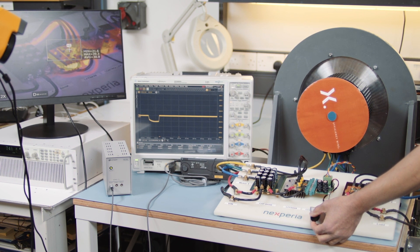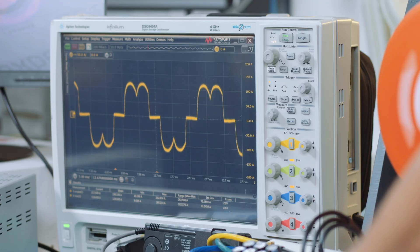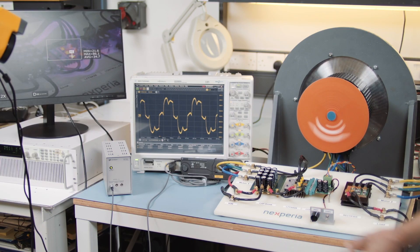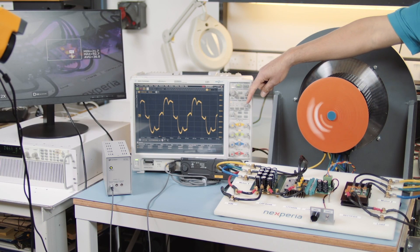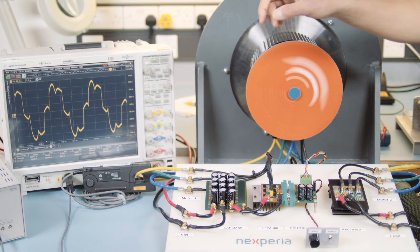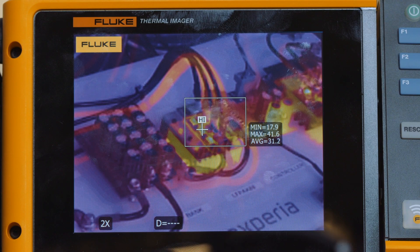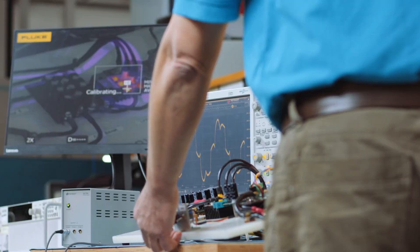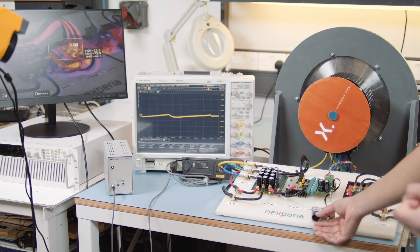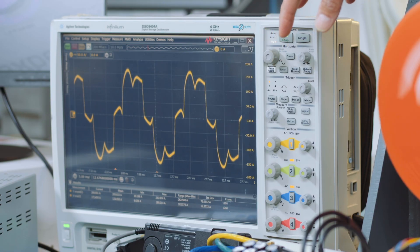We enable it as the motor is spinning. We're increasing the current to nearly 200 amps as can be seen on the scope. This is going through one phase and is replicated in the other two phases. It is a block commutation, trapezoidal waveform. The current has reached the 150 amp desired, although it could have gone further.